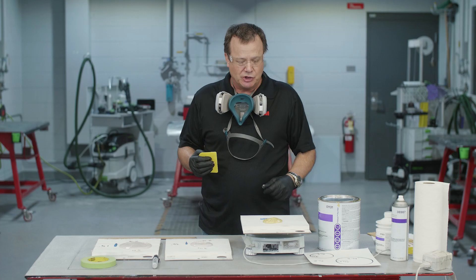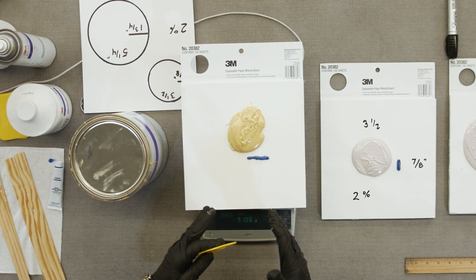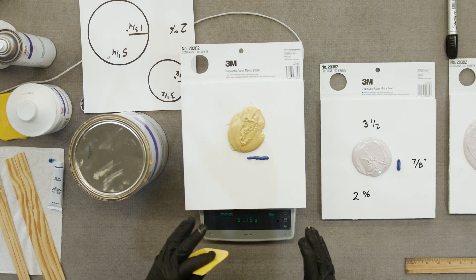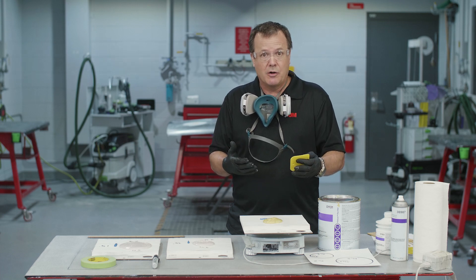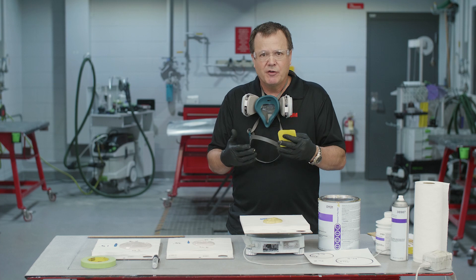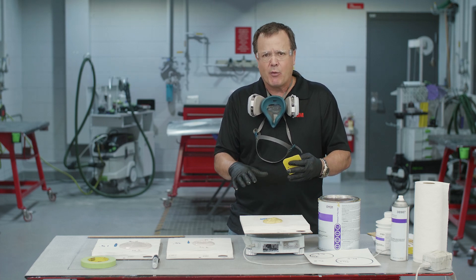This will especially help you when you get that temperature change. You can adjust the ratio slightly — use a little less in the summer, a little more in the winter — but stay between one and a half percent and just under three percent. There are bad things that can happen: with too little hardener it will never fully cure the way you need it to, and with too much you can get air pockets, staining, and even bubbles from the heat if it's way over-catalyzed. That's why it's important to understand catalyzing and keep that ratio fairly close.